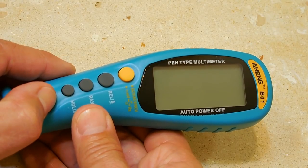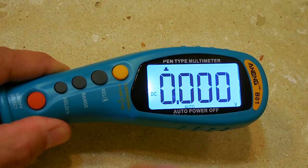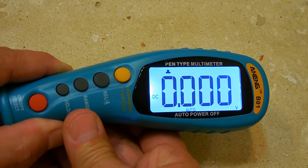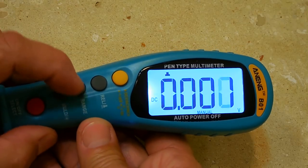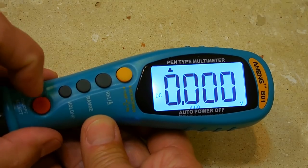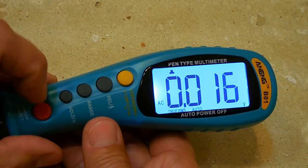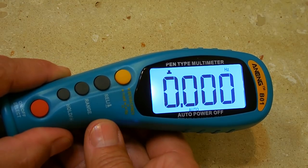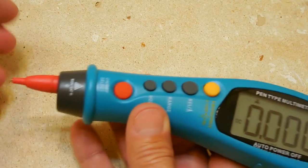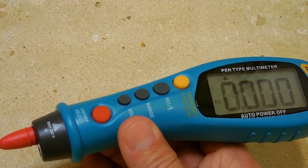The unit is powered up. Push the red button and hold to turn on the backlight. You can see a button sticking up indicating the button-out mode. Push it in to switch between modes. In the button-out mode: DC voltage auto, or push range for manual, push and hold to return to auto. Push select once for AC voltage — auto or manual via range button. Push select again to measure Hertz, shown in the top right. Push again for voltage sensing mode, shown as EF on screen — place the tip close to an AC wire or receptacle and you'll get an indication if the wire is live. Most digital multimeters don't have that built in.